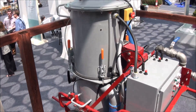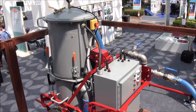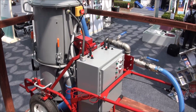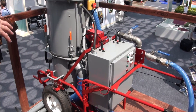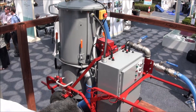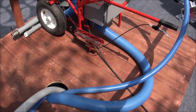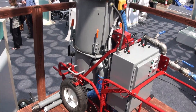This is one of three mechanical pumping systems that have been developed. This is called the wet extractor. It pumps septage, so up to 5% solids. The fatter hose is the intake line — we pump the pit material into this tank, the liquid level comes up, and then a grinder pump inside starts to cut material up and pump it out through the smaller hose. We can pump 50 meters of 5% solids to a vacuum truck or a tanker used to carry the material away.